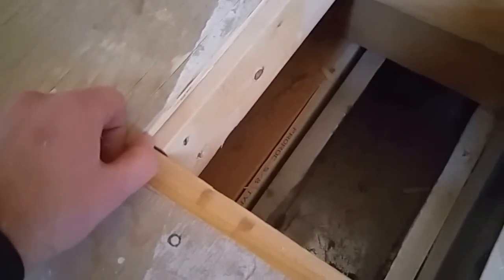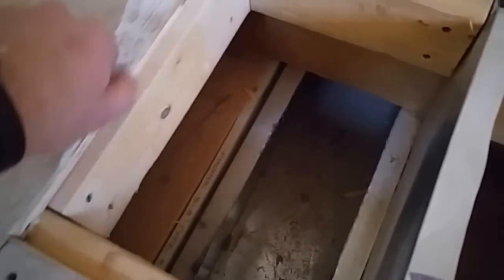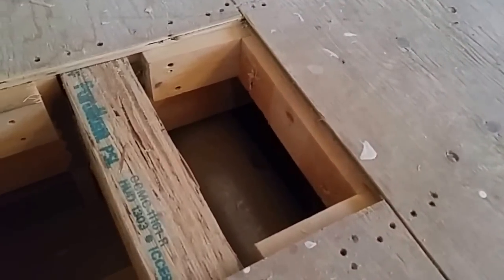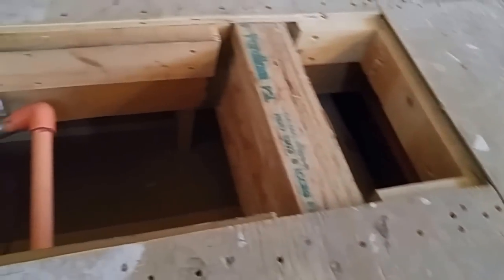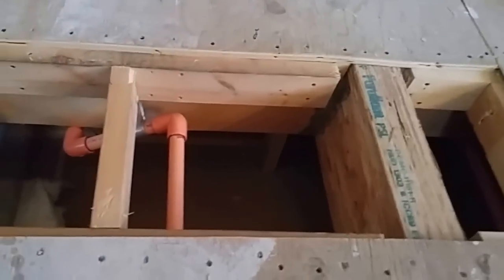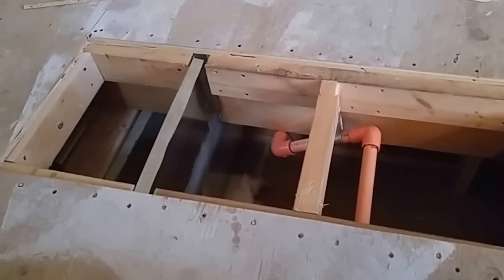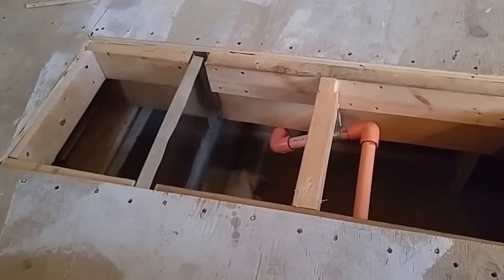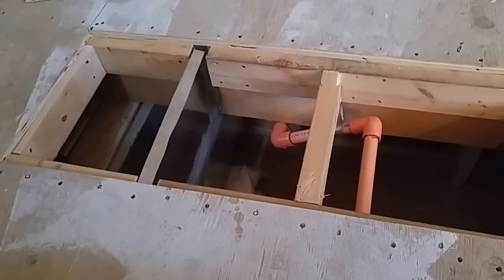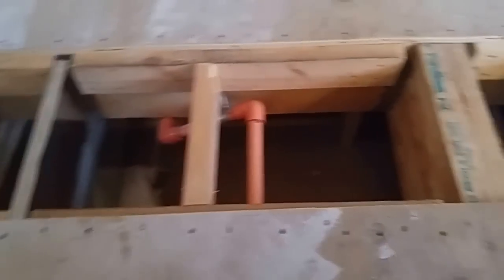Okay, so what I ended up doing was, there's a tongue here for the tongue and groove for the subfloor, and I used the saw and just cut that tongue off of there so that it has a nice smooth edge. This end is the groove, so I don't have to worry about that. And this is a 5/8 subflooring, and for doing some kitchen work and repairs, I have a nice finish, I think birch. It's a plywood with a nice birch finish to it, right here.